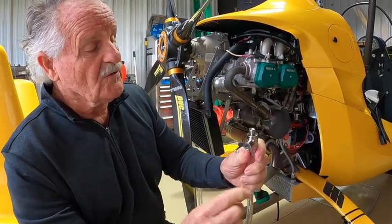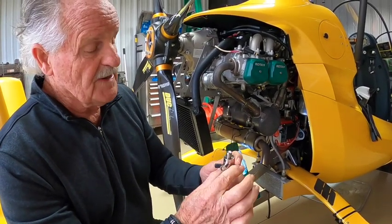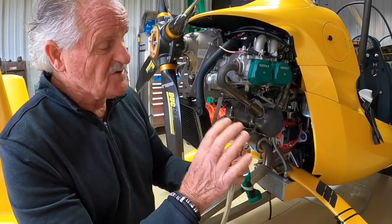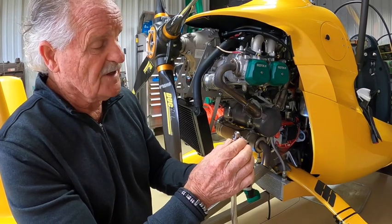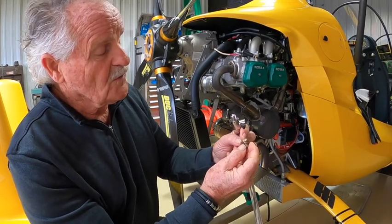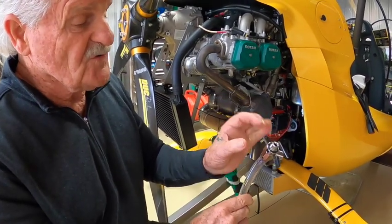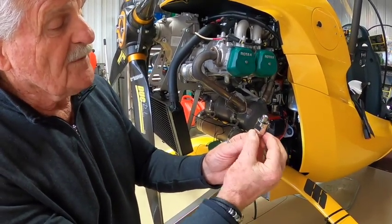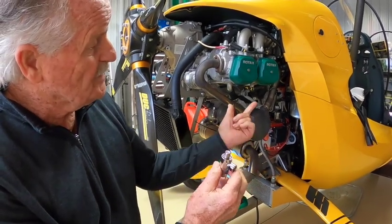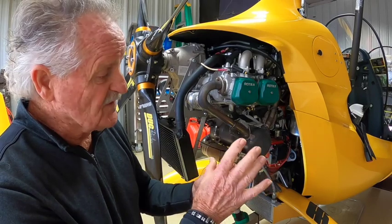And also, when you thread the ball valve into the canister, it also has a little O-ring seal. But it's best, once you tighten it, don't get it too tight, just snug it up. And you want to safety wire it, because your original plug comes with the provisions to safety wire this plug. And you want to do the same thing. Just wrap the safety wire around the basic housing of this ball valve. And there's a tab with a hole in it on the bottom of your oil canister that allows you to run that safety wire through and to safety wire the unit in.